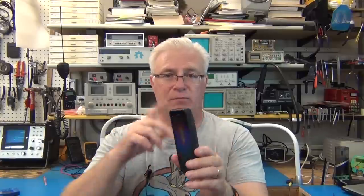Everything else — an amazing product. Even though the software is buggy it's going to be fixed; it's very powerful and does a lot of the things you want, especially with circuits. The technology has come so far down in price — $360 for a full-on FLIR camera. The camera runs at 640x480 and shoots at about five to seven frames per second, so you don't want to move it fast when recording.